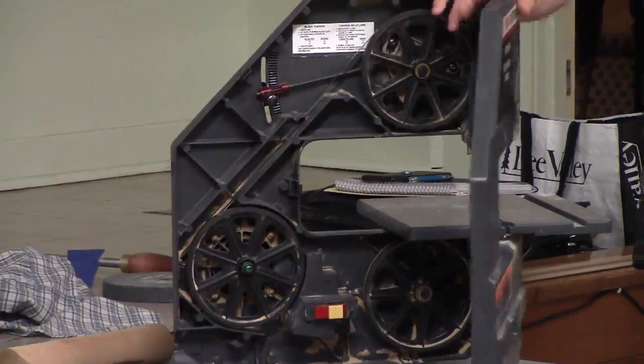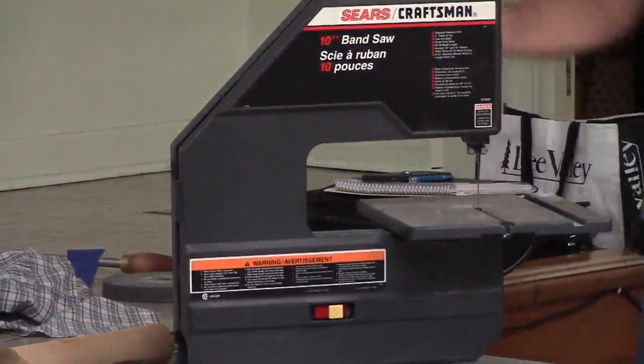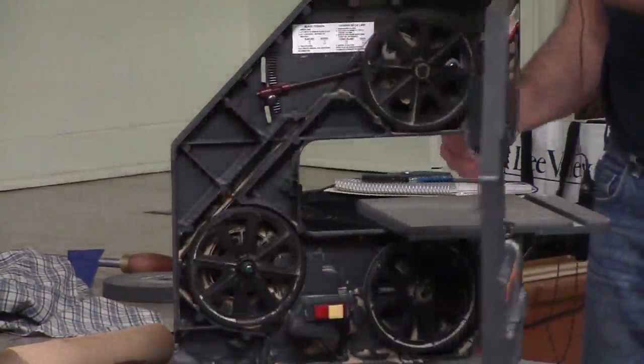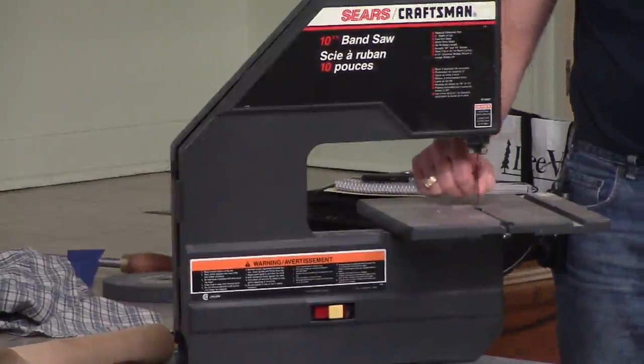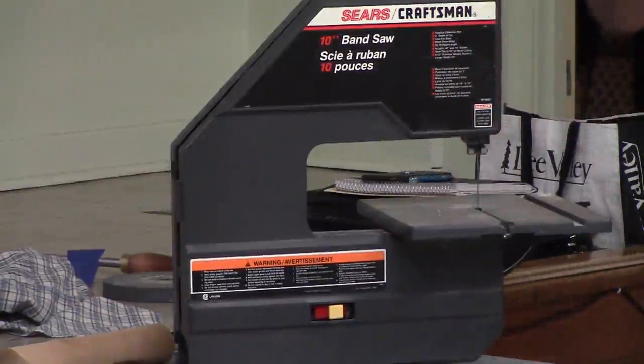The second way — it's really technical, so be careful. If you look at the blade when you get it running true and straight, not plugged in, you just turn it by hand. It should have about a half-inch deflection when you push it with an easy finger. But how much force do you use to get that half inch? That's the ambiguity. You can do it that way.